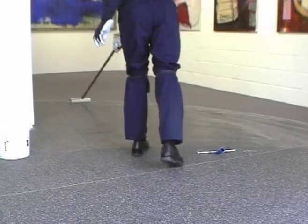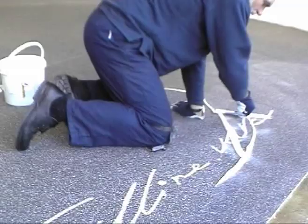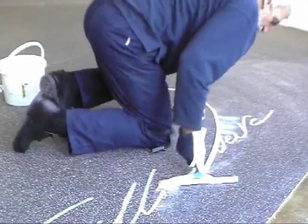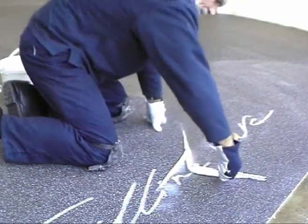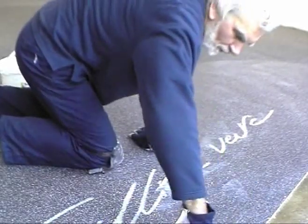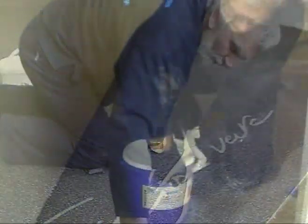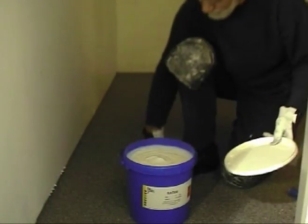Mortar stone flooring is essentially the same product as our standard quartz flooring, except we utilize much finer granules and more binders. The result is a totally sealed, smooth floor system that will not allow any moisture to penetrate. The installation process for a mortar floor is the same as our quartz flooring, but much more care and installation expertise is required to ensure a uniform, smooth system result. Once the fine granule system is installed, the sealing procedures can begin.